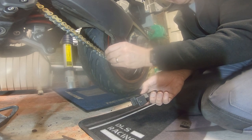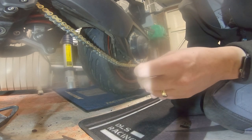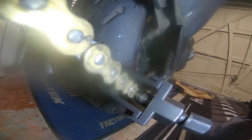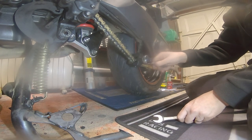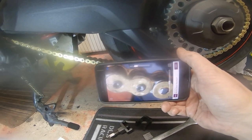To rivet with the tool, this end does the riveting — it goes over here and splays these ends out. You literally compress it until it hits the plate, which means you've got the right amount of displacement. So that goes in there — you want to be in position B. See, that's completely over the rivet on both sides. Now we just tighten that off. Hopefully you can see it's sat on the rivet on both sides — and now you can see they've splayed out nicely.